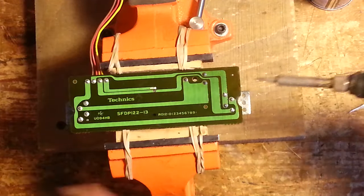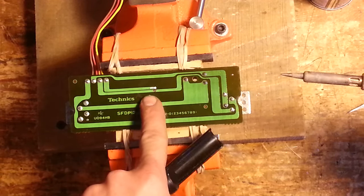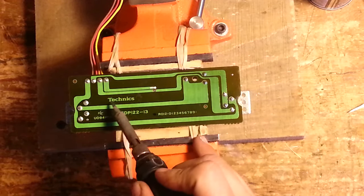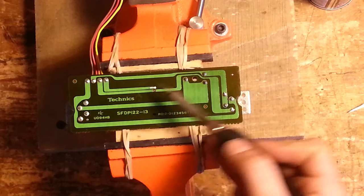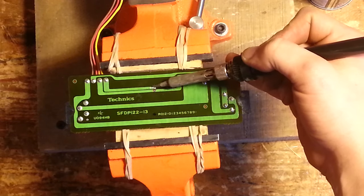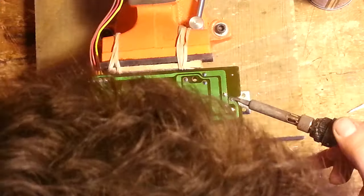So we're going to start — you have four here, four here, and then the LED up top. The LED we need to remember the orientation it goes back in. The easiest way with a Technics 1200 fader is: if you see the word 'Technics' here facing us upright, the positive side of that LED is the top one, and they actually fold it over for you because the LED on the positive side has a longer leg — that tells you the polarity.